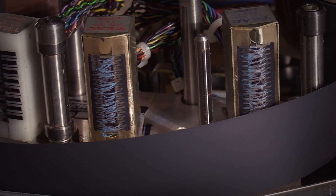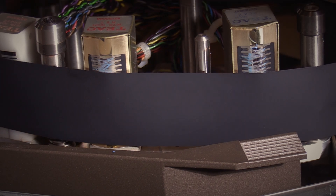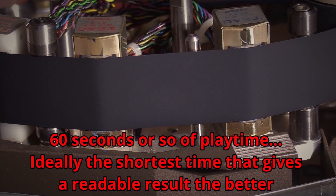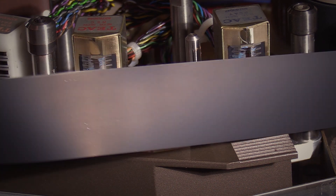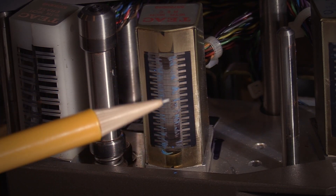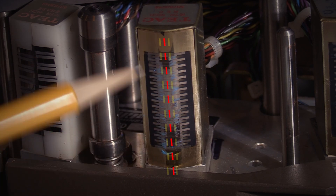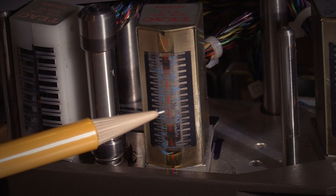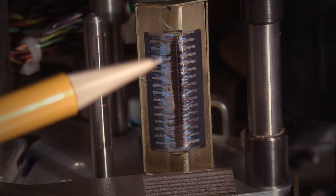Let's turn the machine on and play the tape. Looking at the reproduce head first — you can see where the china marker has worn away and it is directly centered on the right side of the triangle point. If you follow it straight down, it's right in the middle of the wear pattern. That's exactly what we want — the wear pattern is more or less uniform. I'm really happy with that.